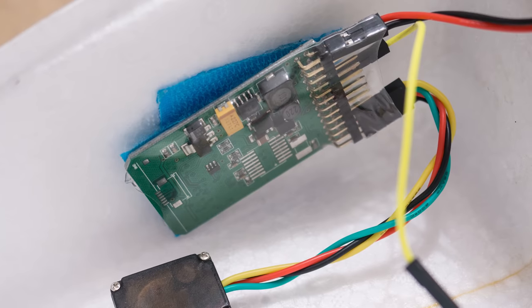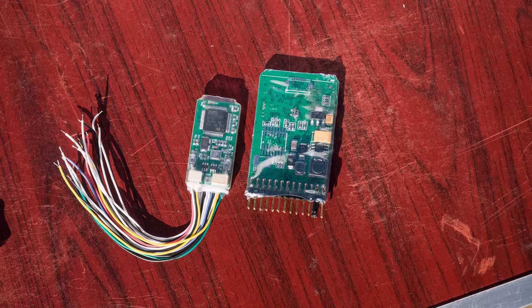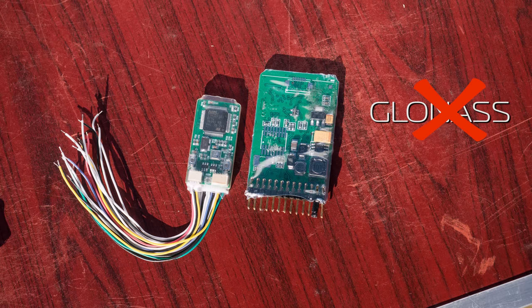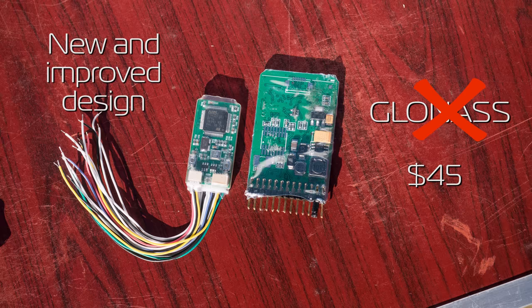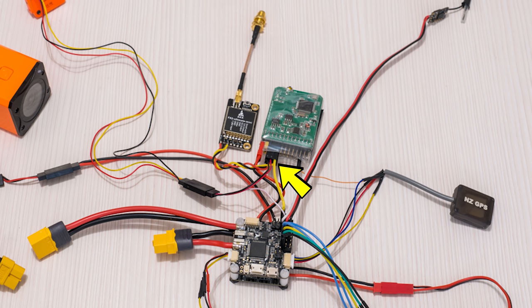In all honesty the only advantage of the Telefly Pro OSD board is that it can easily power its own GPS module without heating up too much. But on the downside it is a lot bigger and bulkier, does not work with GLONASS GPS units, and costs almost twice as much as the Telefly Tiny OSD. As for the Telefly Tiny, it is the newest design and very compact so it will work on smaller models as well, does support GLONASS, and is a lot cheaper. What I do is feed it the video line after it has gone through the flight controller or another OSD, making sure the Telefly OSD is the last thing before the video transmitter to keep other OSDs from messing up the tracking data.